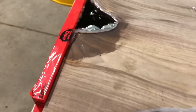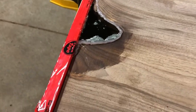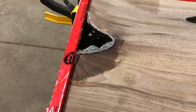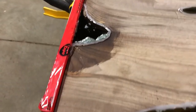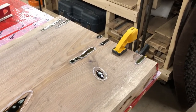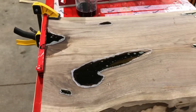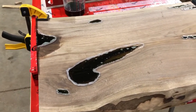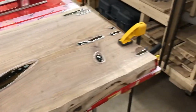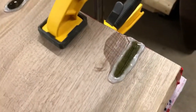I still managed to make a mess even though I was trying to be careful — stuff happens, it's not the end of the world. I try to wipe that up so it doesn't soak in as much. The video I did before this explains a little bit better why I clean that up, but this epoxy soaks in far like any finish does. Depending on what you're going to topcoat with, that could be a concern, so my suggestion is just clean it up as best you can if you make a mess.